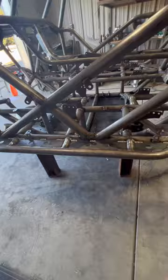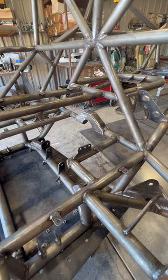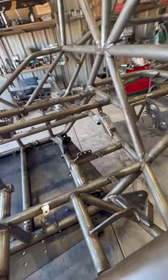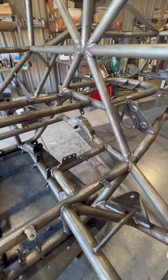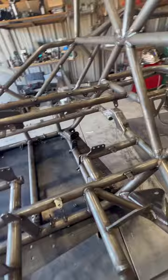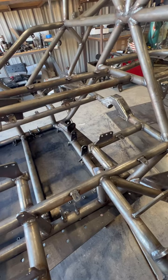The back section here in this particular chassis, you can see the floor tube. We've Frenched in a driveline hoop down in there. And that's because this chassis is getting 16-inch coilovers on a 1.7 ratio trailing arm, which yields about 28 inches of travel. We're using high pinion axles, so it puts the drive shaft way up into the chassis. So we offer the driveline hoop there so that you can raise that driveline up. It's about 2.5 to 2.75 of an inch from the bottom.